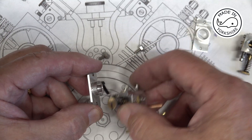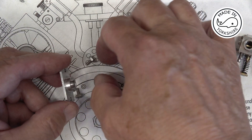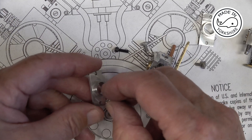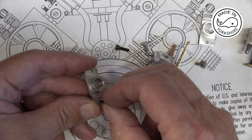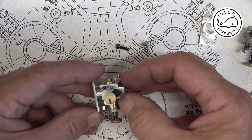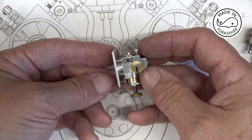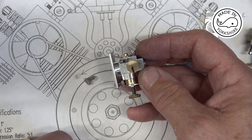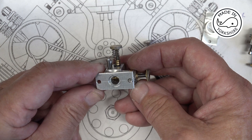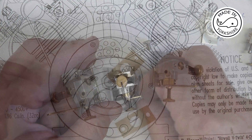My plan is — since I've made this boss a little bit wider — rather than use these cap head screws, I've got some other cap head screws with the tops cut off and I'll attach nuts to the top, so it's only the bottom one that interferes with the carburettor. I'll Loctite it together and then I can fiddle around with that and attach it to the cylinder head using a spanner. I'll do the Loctite on the surface plate to make sure it's spot-on level.